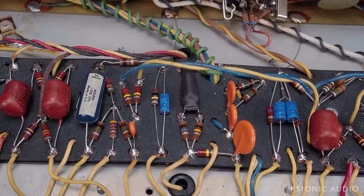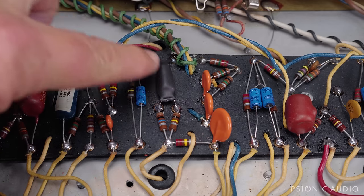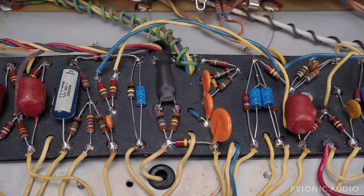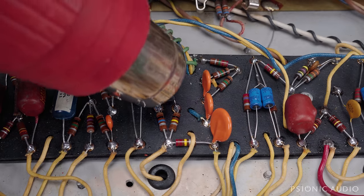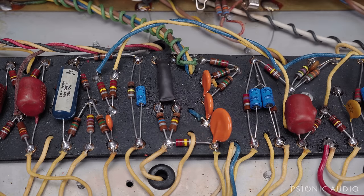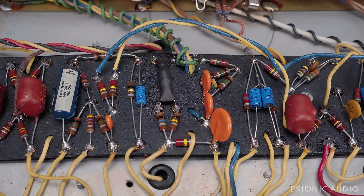Now I'm going to show you what I like to do at this point. We turn the amp off. This roach inside this shrink wrap is two parts — we call the whole thing the roach because it looks like a bug. On one side there's a neon bulb; on the other side there's an LDR, which is a light-sensing resistor that changes its resistance based on how much light is present. These come in this shrink wrapping but it's very loosely applied. I know right now the bulb and the LDR are lined up properly, so I like to go in there and shrink it a little bit more so I know they cannot move in relation to each other.